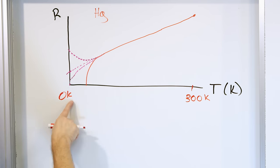And one last thing I'll say is that in order to connect these things, because I had to do it for so many years, you get under a microscope and you get this indium metal. It's a metal on the periodic table called indium. It's quite expensive, but it spreads like peanut butter. It's kind of a soft metal at room temperature, and literally under a microscope with tweezers, you spread the indium metal on the superconductor and you connect your wire.